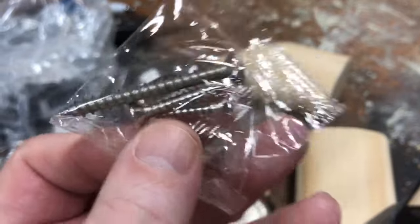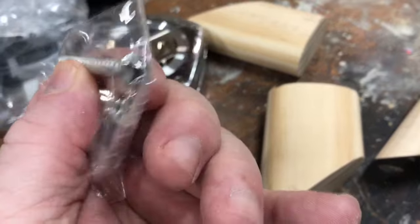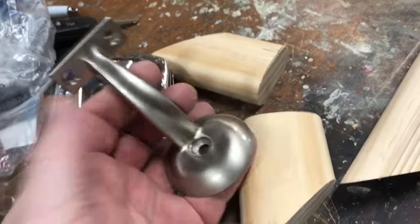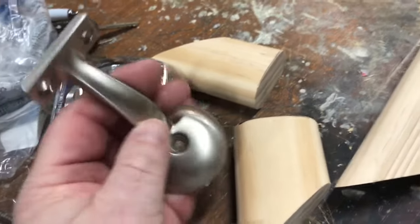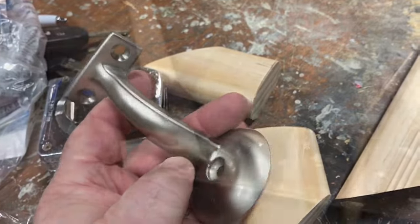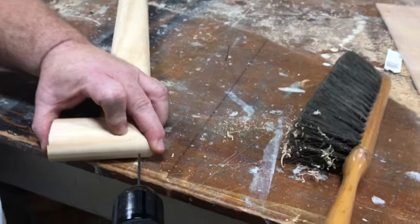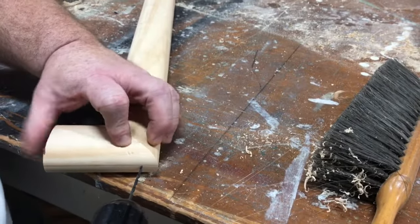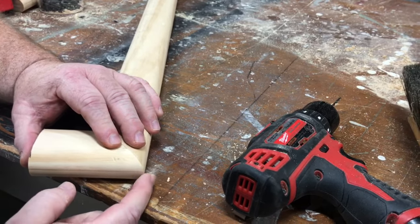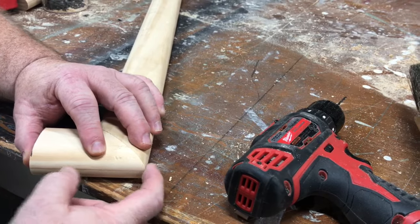See that big honker right there — these two mount it to the handrail, this one goes to the wall. Trust me, if you listen to anything I ever say in your life, use this kind, not the other kind. First we're going to pre-drill a hole right here, and hopefully this won't slip. One reason why I cut them about an eighth of an inch longer is because I like to start with this tip hanging over just a bit — see how it's hanging over just a bit?